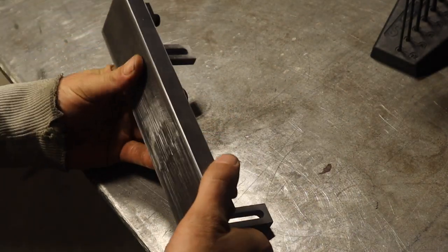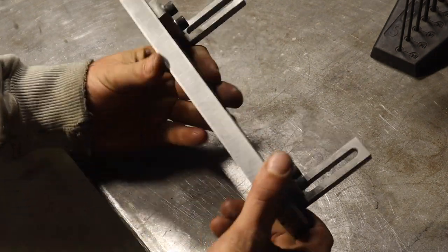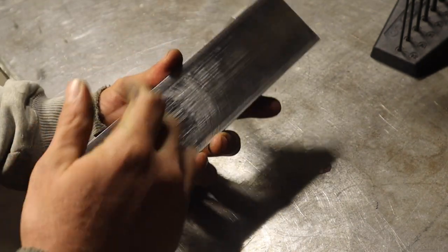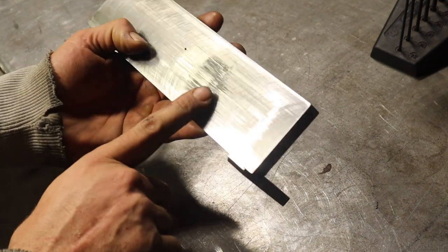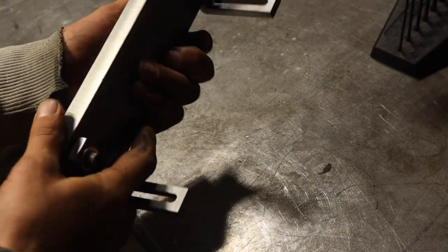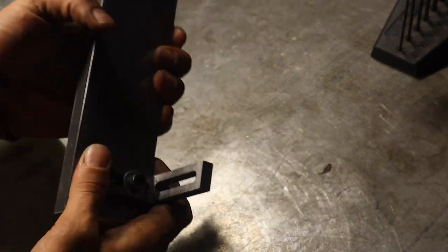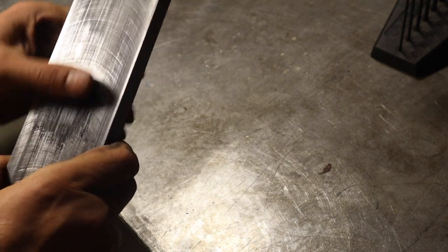So there it is. If you're wondering why I made this so stupid thick, it's just because this is 1018 mild steel. And ideally, this should be made out of hardened steel. I know they sell ceramic ones and things like that. You can see with the limited use, it's already taken some damage. I can't really feel it, but it's only a matter of time. And that's why I made it so thick, so I could resurface this on the mill several times as needed. I just got a heat treat oven, and I think in one of my next videos, I'm actually gonna harden a piece for this platen to test it out.